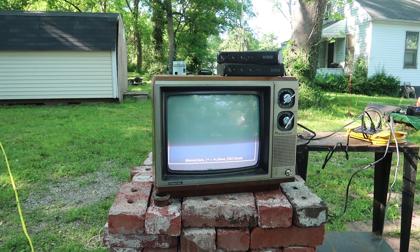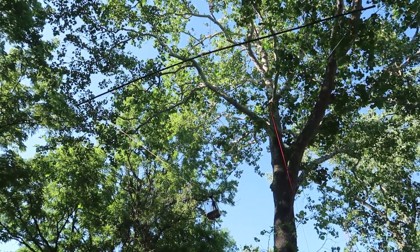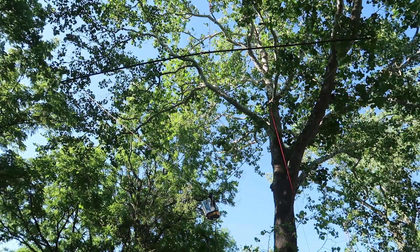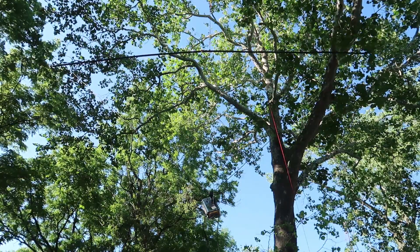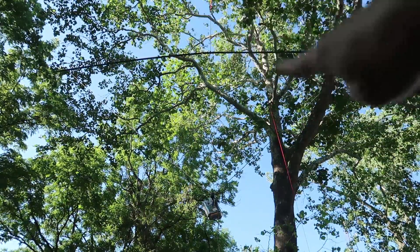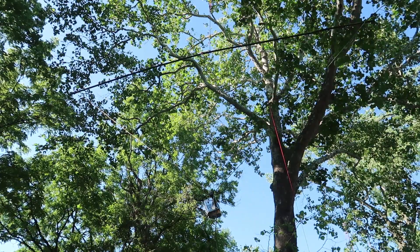That means the wavelength is just about 1.9 feet, and this big beast of an antenna up here is way overkill — that's sized for like 80 megahertz. The lowest channel I could find was 75 miles from here at 180 megahertz, so that's about 6 feet. So we'll take one of these wires, cut it in half and do the same thing. We'll switch back to the PEX pipe so we can have a shorter span and still have a V shape, and maybe get another cable and hoist it up even higher. That's a real shame — didn't get any channels. It's up about 20 feet and it's not detecting any of the channels it should detect, even running it through an amplifier.